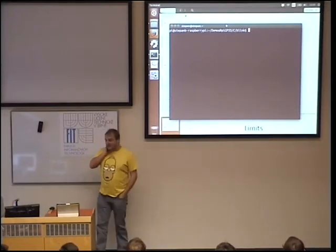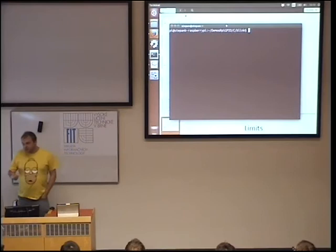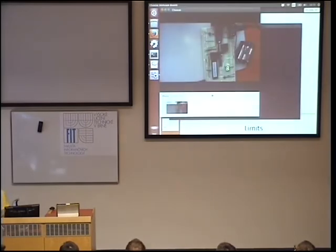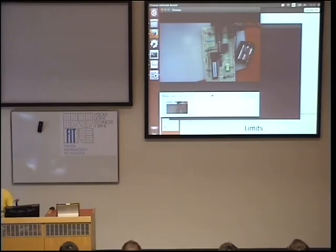My favorite bus is I2C, because it's quite easy to use, and it's quite easy to build your own modules using this bus. You will see how to build those modules today. First, I have a couple of devices connected to the I2C bus. If we go here, the I2C bus is this orange and green wire. They are connected to the Raspberry Pi, and the Raspberry Pi works as the I2C master. Here is the first device, a small matrix display. And this device here is a simple microcontroller based on PIC microcontrollers, and it works like another I2C device. I'm using it to extend the functionality. You will see it later.